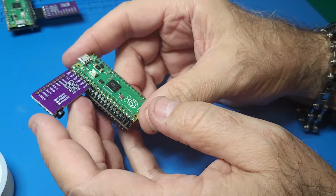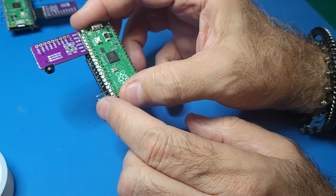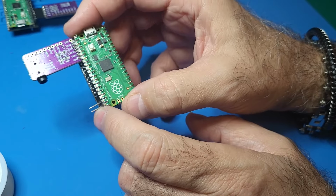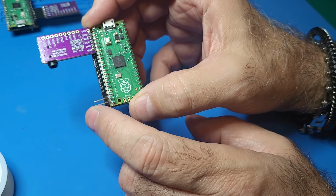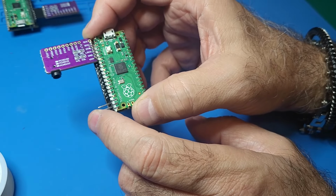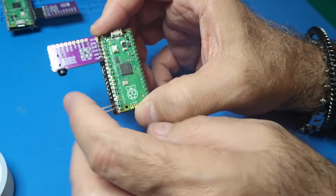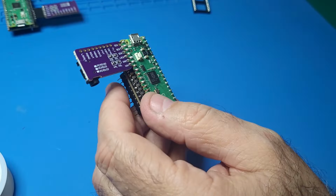Let's go ahead and plug this into the computer. I'll show you. So these are for the address lines. If you're going to use the dual SID, you need to set the addresses so there's no address conflict between the two SIDs. So this will go to two jumpers that we're going to put on the motherboard coming out of the CPU. And I'll show you where those are.